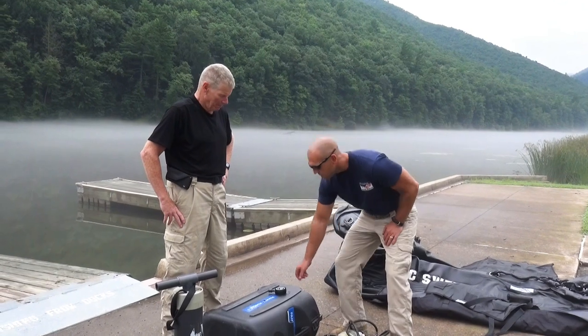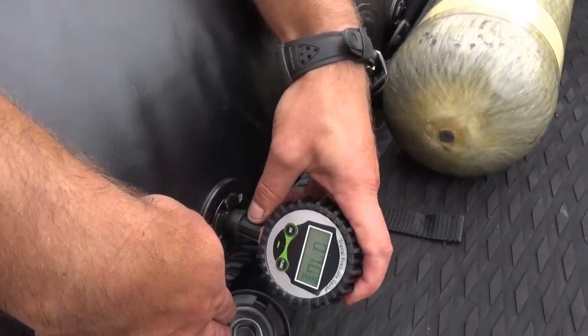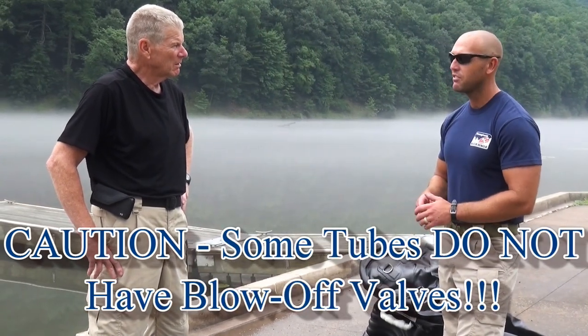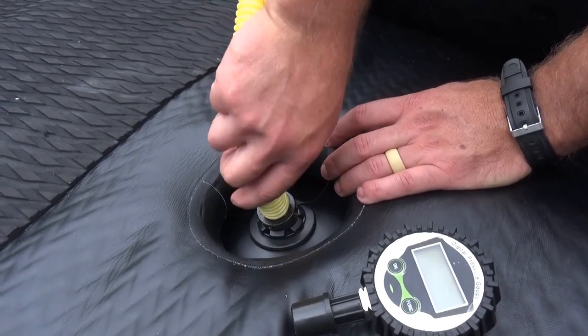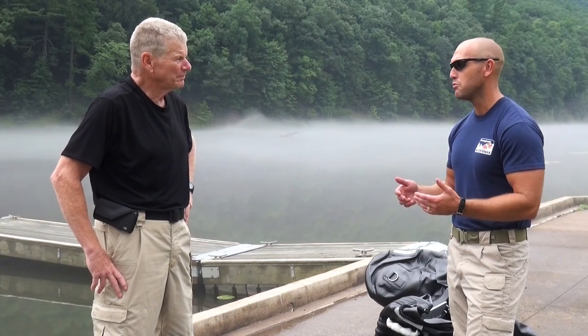You can verify pressure using the blow-off valves or a PSI gauge specific for inflatable boats to test each chamber. Boats also have keels, and some inflatable floors don't have a blow-off valve, so don't use an SCBA to inflate those — you can over-inflate and blow a seam. Use a barrel pump or foot pump for the keel or inflatable floor. If the keel or floor is under-inflated, the boat will cavitate, especially with a motor, and won't provide proper cornering and turning in a swiftwater environment.